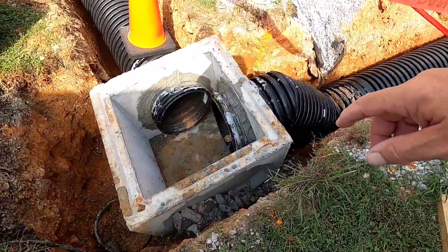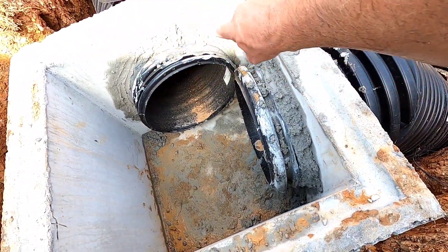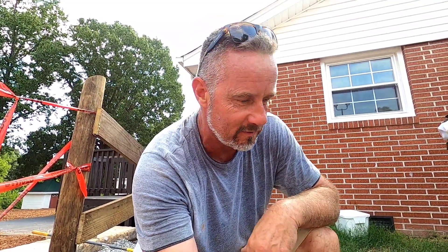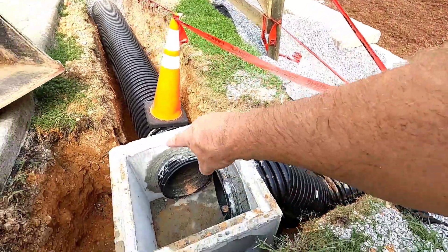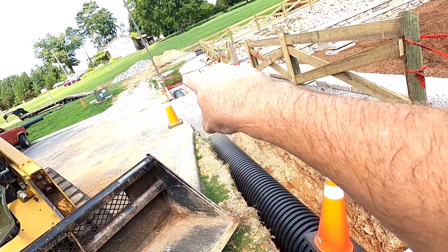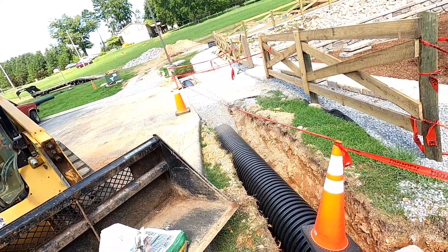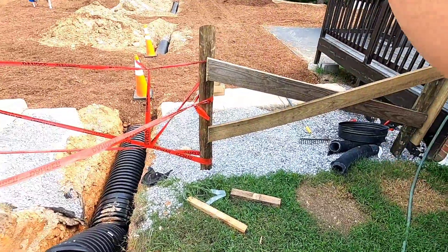Now what I'm working on is mudding in these tiles, culverts, in the box. And my helper Jimmy — he's a pastor at the church here — he knocked some pretty good holes in this retaining wall box, so we've got a little bit of work to do. So we'll get these two finished mudding in. I'm mixing up another batch here, and then we'll get that one — the whole side of that one's going up there. We'll get that mixed up, and then the plan is to build the head wall out there on the end, put that in place, and get the riprap there.